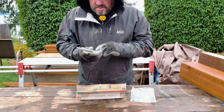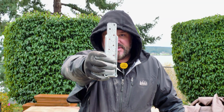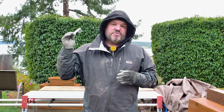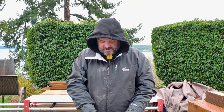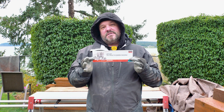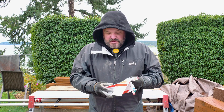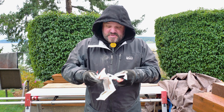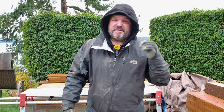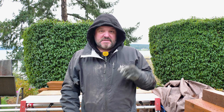These are also Z-Max rated — that's what the 'Z' in DTT1Z stands for, stamped right into the bracket. Z-Max means it has extra corrosion resistance against pressure treated lumber, which is what we're using. These are kind of created for deck builders, though you can use them in other instances — it is a deck tension tie. Of course they always include directions, and we've installed quite a few of these so we kind of know what we're doing. You can also go to Simpson Strong Tie's website — they have all that information there, including all the different ways you can attach these products to your joists.